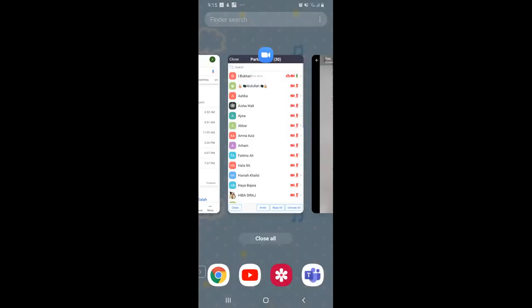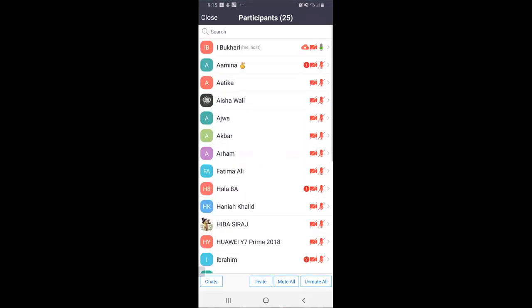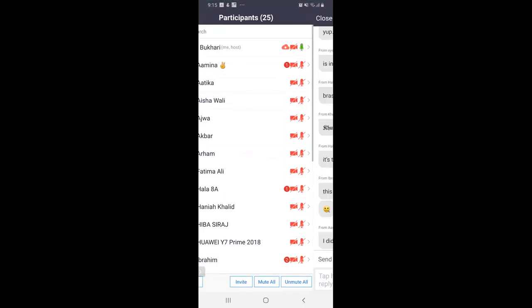And then you will mark that new position as your steam point, okay? Now you have the ice point, you have the steam point. Now you will measure the length between the two, and you will divide that length into 100 equal parts. And so one division of that scale will be as long as your answer that you got when you divided the length by 100. Okay, so that is how you can use a bimetallic thermometer. So that would be the answer to that question. Okay, I hope you guys understood and I made sense to you guys.